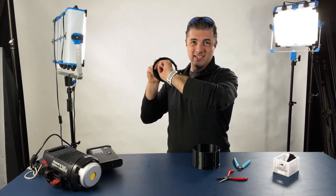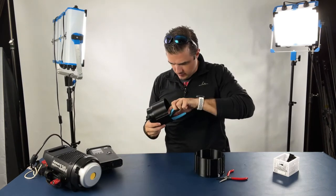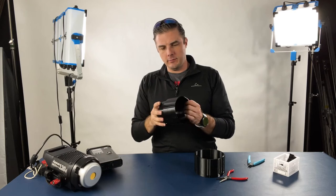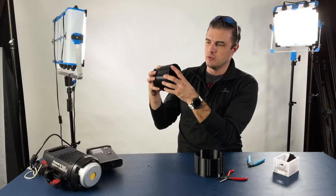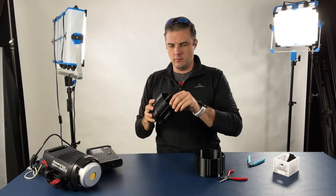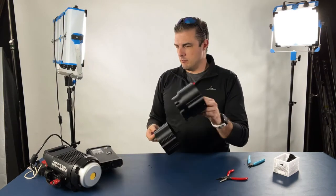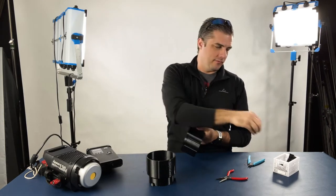I'm pulling all the supports off. There are some vertical supports on the inside for some of the inset screws. This is the first time we're doing this test bench, so we will improve as we go — probably get another camera in here so we can actually see what I'm doing. The black filament doesn't help either, but this is black PETG so it's got good heat resistance, it's pretty flexible and strong. We've got three solid layers on the walls and about 15% infill, which has been a pretty good standard. There's our mount.